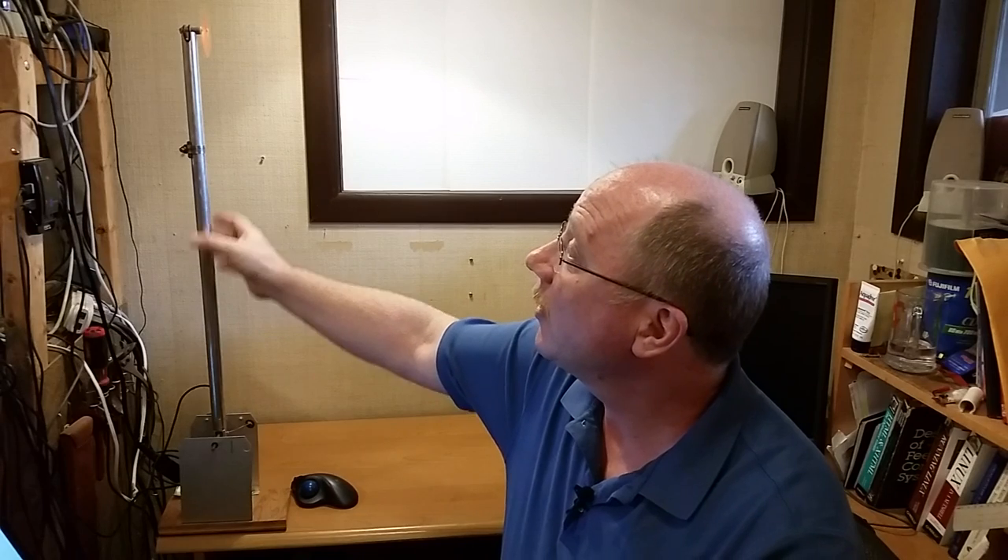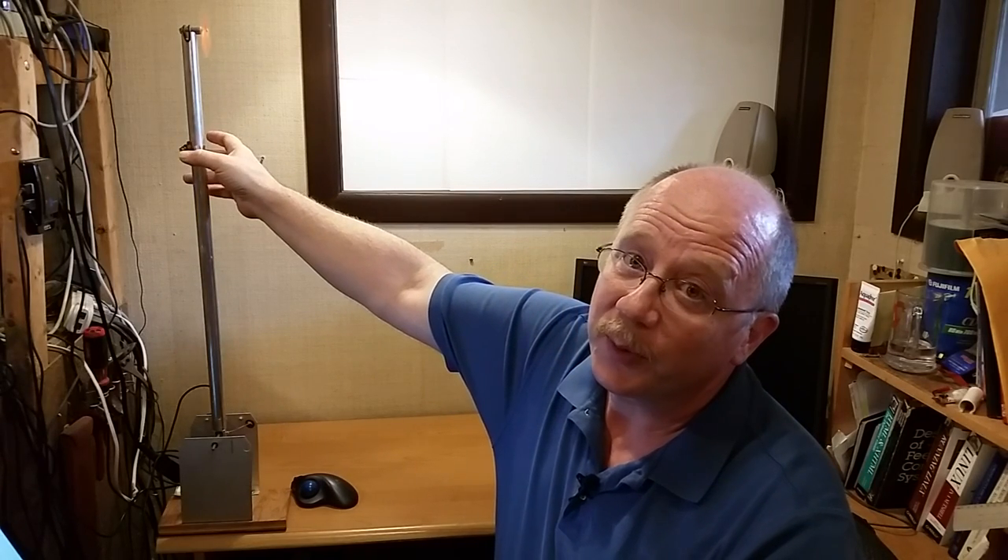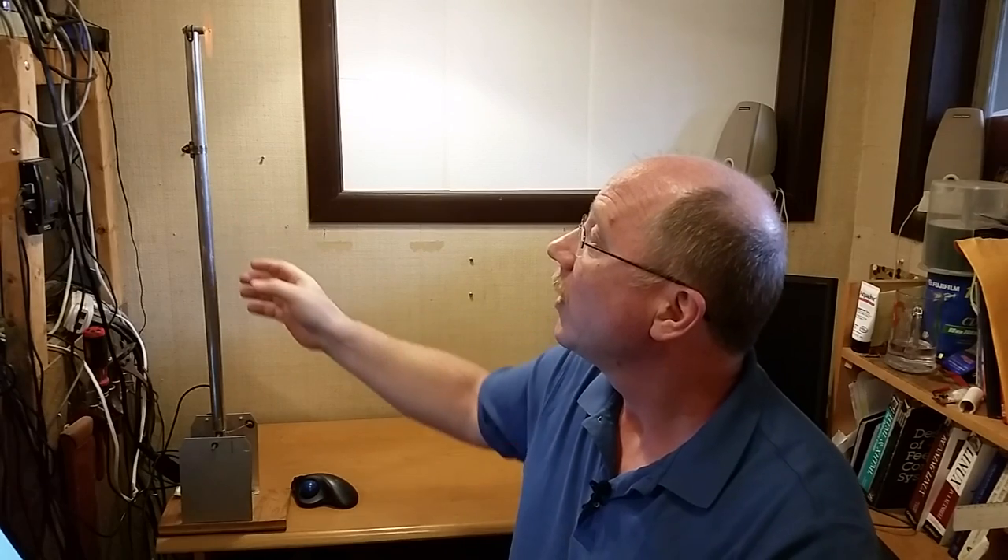We've set the derivative band limit and the derivative gain, but we might want to go back and experiment with the derivative band limit again. I happen to know for this system that it likes the derivative band limit as it's set. You can see that the propeller is spinning just a little bit and you can hear that it's hesitating — it's kind of jittering and going back and forth. So what I'm going to do is just turn the derivative band limit off and watch what happens.